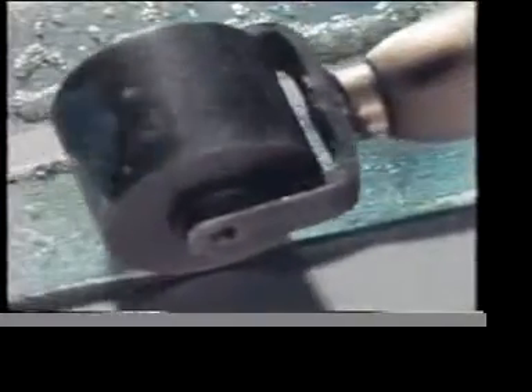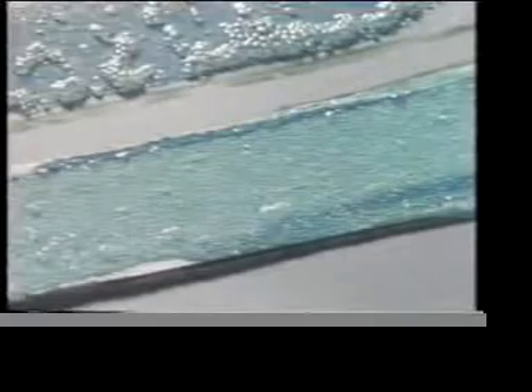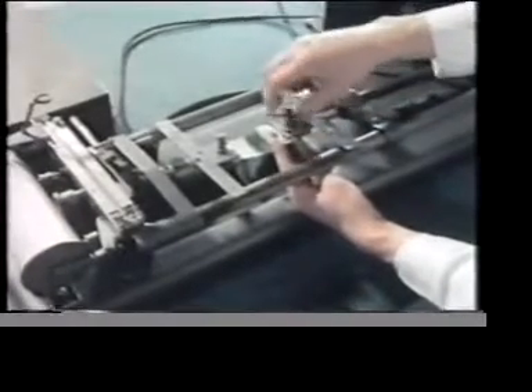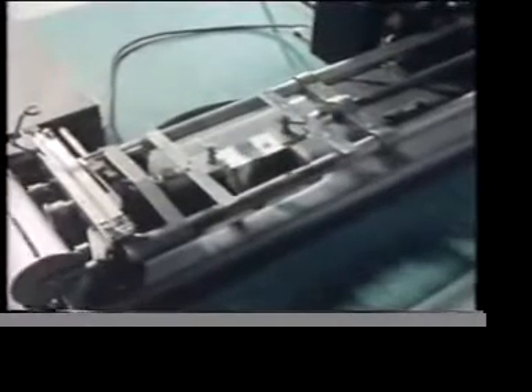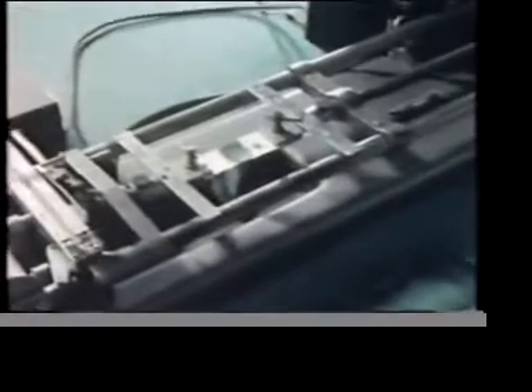We'll roll the two pieces to squeeze out any air. For a bond to develop, the adhesive must be left to dry out. Let's see what happens when we try pulling two similar pieces of fabric apart after the bond has had time to develop. We're doing this in a tensometer. Here we're peeling the two pieces apart. The fabric we've chosen is stronger than the dried adhesive. See how the adhesive is being stretched and torn? The bond is produced by the adhesive wrapping itself round the fibres of the fabric. The adhesive interlocks with the fibres, forming a mechanical key. This is called mechanical interlocking.